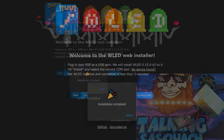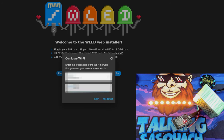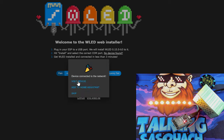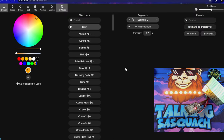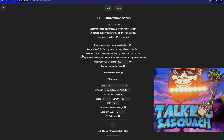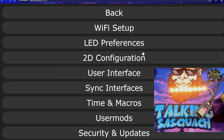And just like that, it's done. We'll also notice that our NeoPixels have now turned orange, which is kind of fun. Click next and it's going to configure the Wi-Fi — it scans all your Wi-Fi and you can hook it directly up. Select your Wi-Fi and the password, click connect, and as soon as it connects to your network it basically runs its own Wi-Fi. So all we have to do now is provide power to the ESP32 — it doesn't have to be hooked up to our computer. One of the first things we'll do is go into the configuration menu, go to LED preferences. Notice it says to keep it less than one amp if powering the LEDs directly from the ESP32's five volt pin, which is what we're doing — but you can go up a little higher and make it a bit brighter.